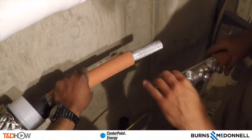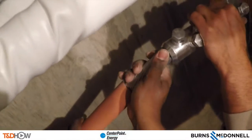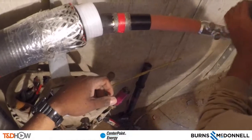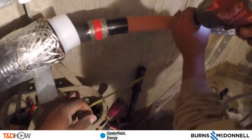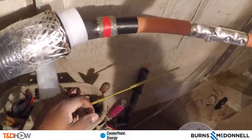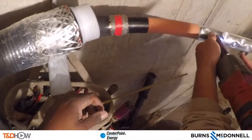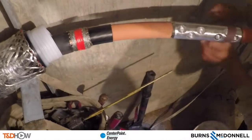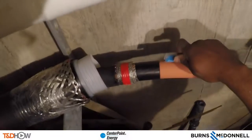This is where we make the actual splice itself — inserting the exposed conductor of the cutout into the shear bolt connector on the existing cable, creating the splice for this cut-around. Next, we take a cordless ratchet and tighten down these shear bolts. The reason they're called shear bolts is that as you apply the right amount of torque, the bolt head by design snaps or shears right off, giving you a flat surface.